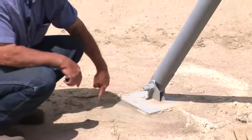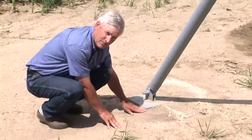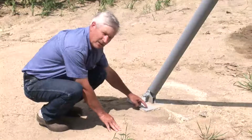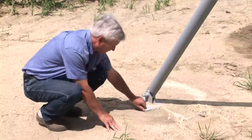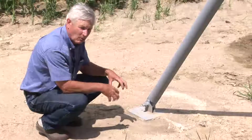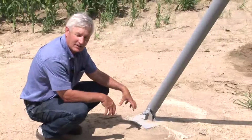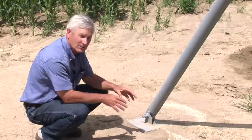There's a 3-foot diameter hole, as you can see right here. There's concrete 5 feet deep right here, and there's some big bolts that go down into it from this plate. There's a 1/2-inch plate right here, and in that 1/2-inch plate there's 4 big bolts welded, and they go way down in that concrete, and then there's some huge rebar down in there that supports this whole system.